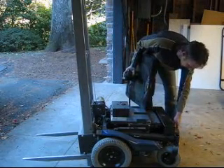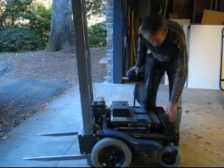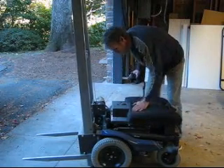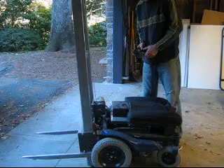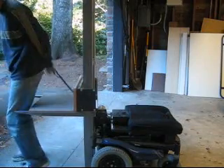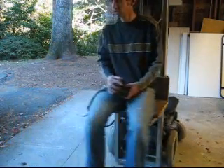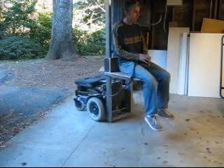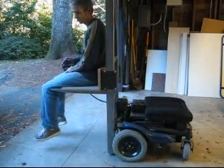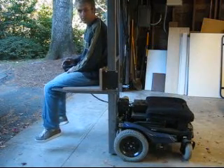I've got about 44 pounds of lead weight on the back here, and another 140-pound box that I made for the lead shot. Control box for the controls here. You can see plenty of weight in the counterweights. I told myself I could move her around without a driver in the back, but I definitely want to have counterweights plus my own weight if I'm picking up quite a bit. What I'm going to do up next is pick up quite a bit of concrete.